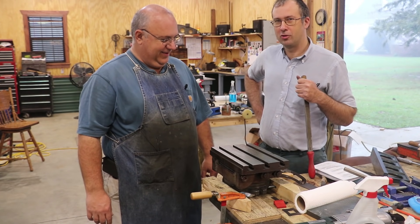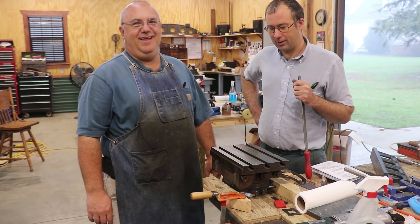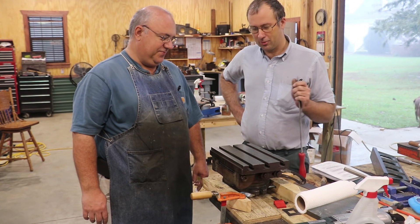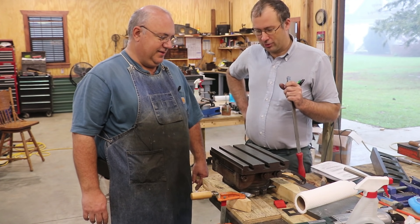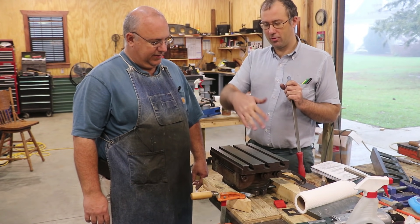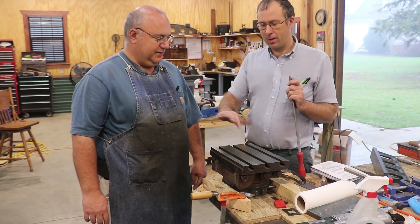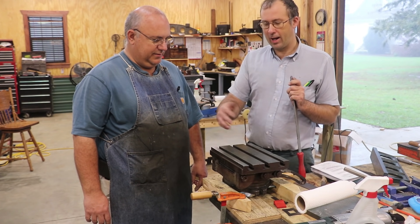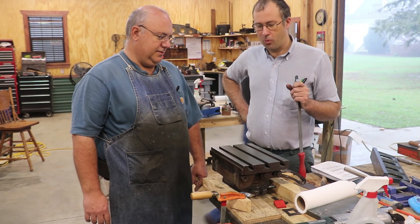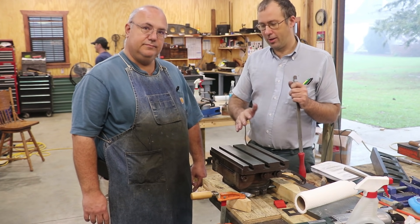I'm Brian Block. I've got the YouTube channel BC Block 02 out of Kentucky, where I do typically bigger jobs than what I'm doing here today. I've decided to come down south and try to learn a new trade because you never know what you might need to be doing someday. My project is a universal mill table that I use on my mill for setting up to do odd angles — you can pivot and swivel it around. It's like a compound sine vice except it uses a swivel instead of two nineties. Since you've got three axes, they all have to be either parallel or perpendicular to each other.